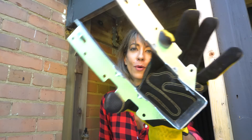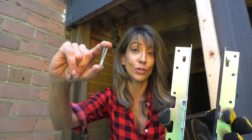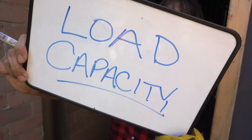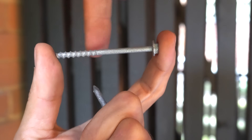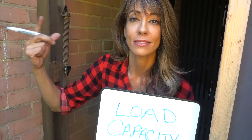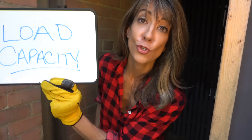These joist hangers are good for your 2x10s. When you pick up your joist hanger, you have a choice of using a rated screw or a rated nail. But head to head, what is better? What's above me right now is a deck, and what is bearing down on it? Bearing means there's a lot of weight or load. Which one is stronger for load capacity when you have a lot of people on your deck? The screw comes out as the winner for load capacity — and a lot of people don't know that. Load capacity will vary depending on fasteners and sizing, so this is really just an apples-to-apples comparison for joist hangers.